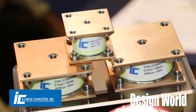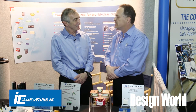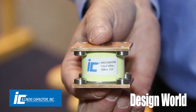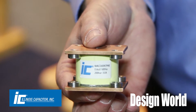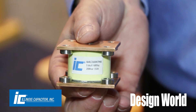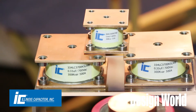The manufacturing of these is proprietary. You can't just make it like a standard capacitor would be made — there are special connections and all that have to be done. So I can't just slap a heat sink on an ordinary capacitor and come up with one of these? Not that it's going to be reliable. The capacitance range goes up to as high as five microfarads, and they can take six to eight hundred amps RMS.